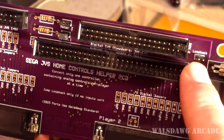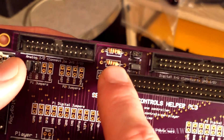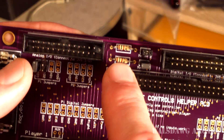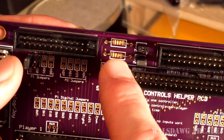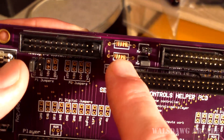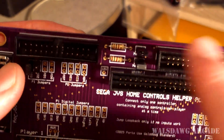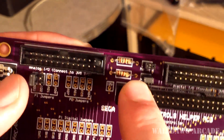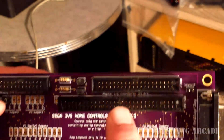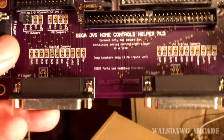This thing also takes care of a few things automatically. It provides an automatic loopback so you don't have to worry about looping back the power to power the IO. It also has two resistors — those of you who work with IOs know you have to add a 100-ohm resistor to emulate a coin meter for certain games to even boot, or the game won't let you add coins if there's no coin meter present. I built that into the design, so if you buy this, you don't have to worry about it. Just plug in the ribbon cable from the PCB to your IO, plug in your controller, and it'll work.